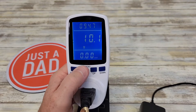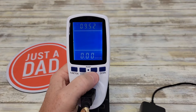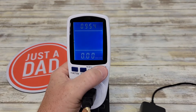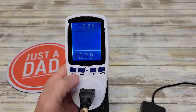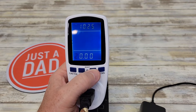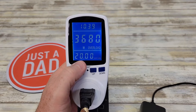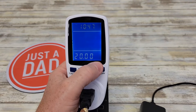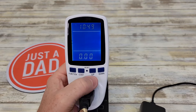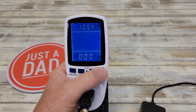Now that we're on the watts display, press and hold the cost button for three seconds to change the cost setting. Once the kilowatts start flashing, press the function button, and then I can press up or down. This is the cost in dollars per kilowatt hour — you may need to check your electric bill to see how much each kilowatt hour costs, and that's how you change it.